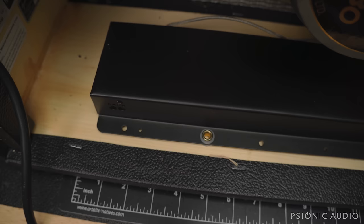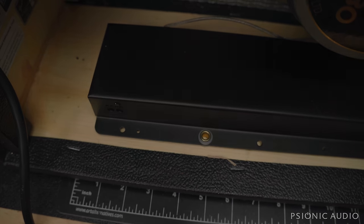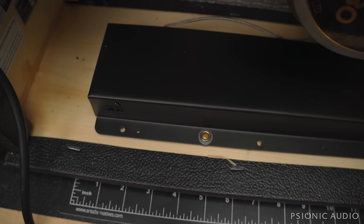Power it on. Wait till we hear that wonderful white noise with the volumes at zero. All right, let's bring the reverb up now. No more feedback. Let's get a guitar in there and make sure everything's working. The tank still feeds back at the highest setting, so we put in the Mojo Tone test tank and we'll compare that.